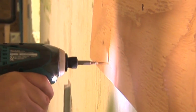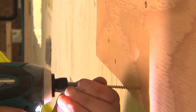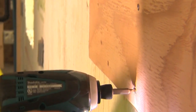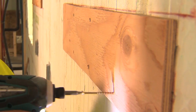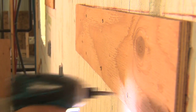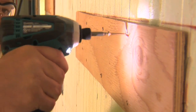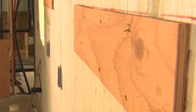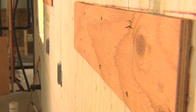Start by ripping 4 inch or 102 mm wide — or wider if needed — pieces of 5/8 inch or 16 mm thick plywood for the regions where fastening will be required. Then cut the plywood segments to the required length and screw them with No. 8 minimum flathead coarse thread screws into the webs. This method can be used for a variety of installations.